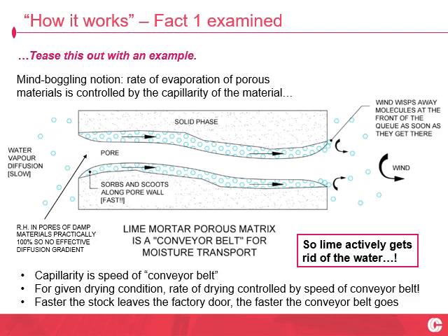That's a very fast, very efficient way of getting mass out of the porous fabric. The other thing with water vapour is that as soon as the molecule of gas bumps into a pore wall — and pores are very tortuous, very twisted — it's essentially a certainty that the molecule will bump into the wall at some point, adhere, and then move through in the liquid phase. So the whole idea of water vapour just blowing through the wall is manifest nonsense. Masonry wouldn't be a very good walling material if the wind could really blow through. So let's just abandon this idea of vapour permeability.